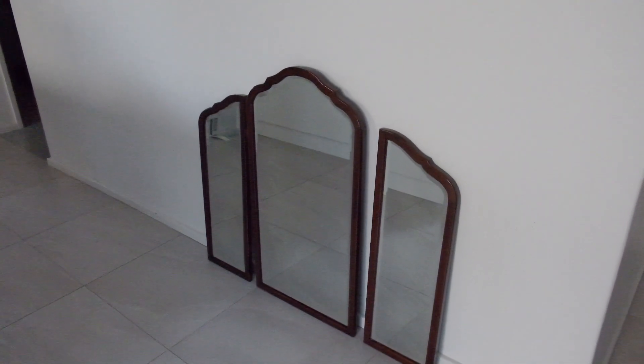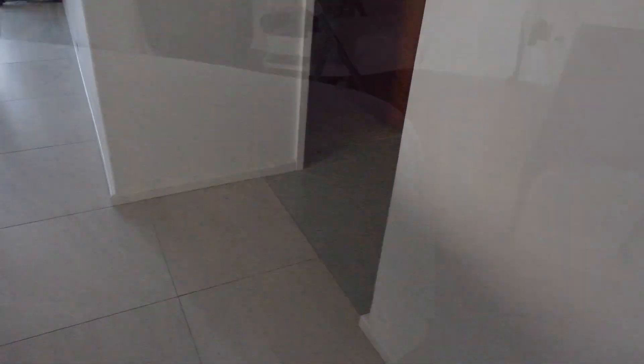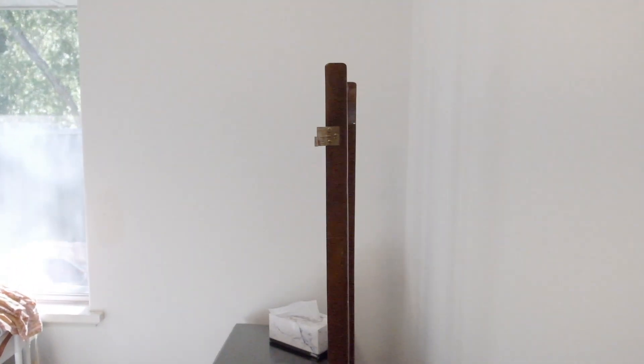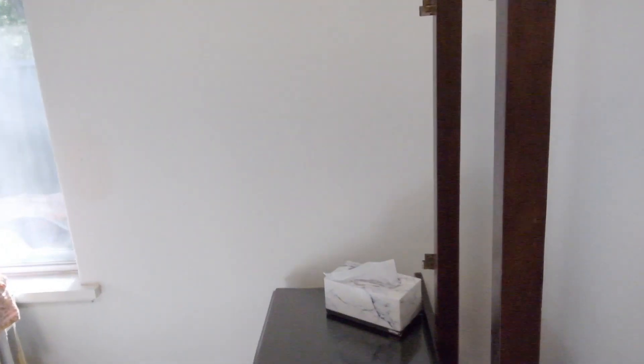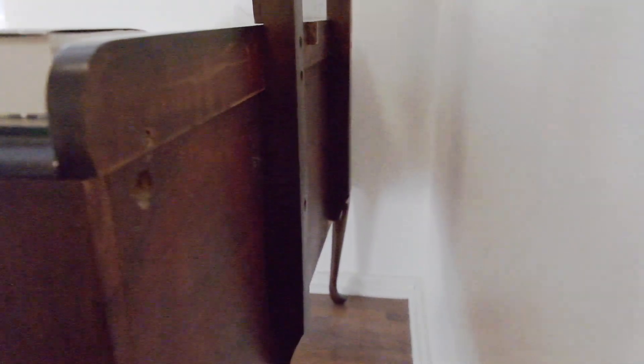In the meantime I'm going to try and make vertical these bits on my dresser. I'm not sure if you can tell, but these are not sitting vertically — one more so than the other. I'll just hold a level up so you can see just how bad it is. Okay, so that is a long way off level. I'm going to try filing down — I would use a plane if I had one — so I'm going to try planing off the inside of this support and then we'll give it another try.